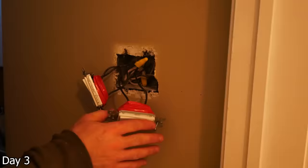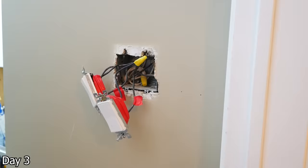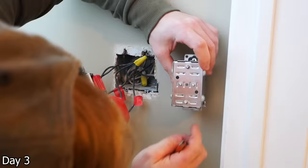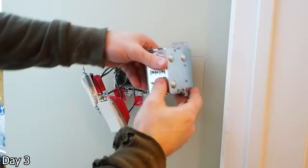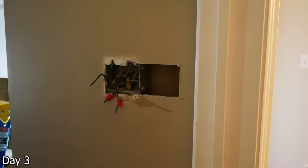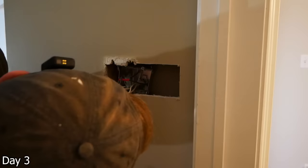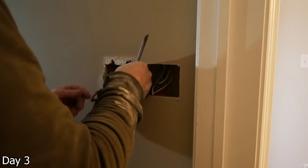The current bathroom only had two switches, but we want four — for pot lights, wall sconces, the exhaust fan, and a towel warmer. We're removing the existing two-gang box and adding a four-gang box. First, cut out a hole that will house the four-gang, then label the wires and shut the power off at the circuit breaker. Pry the box away from the stud and get all the wires out. This will enable us to bring new wires down and rework the current electrical system.